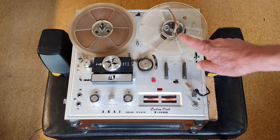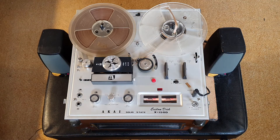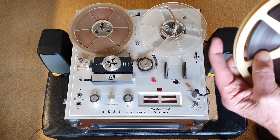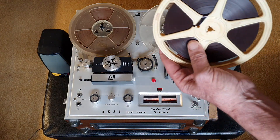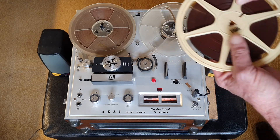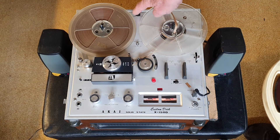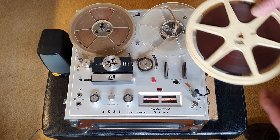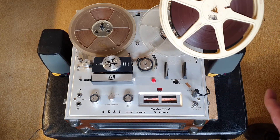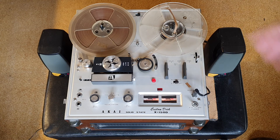It's great for showing the way that tape recorder machines work. Later tapes were made of mylar — a plastic tape that's thinner, so you can fit more onto the reels. You can also record at different speeds depending on how much quality you want: the faster the speed, the higher the quality, but you don't fit as much onto a tape.